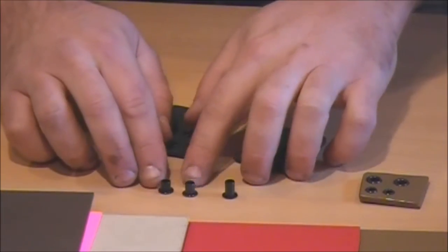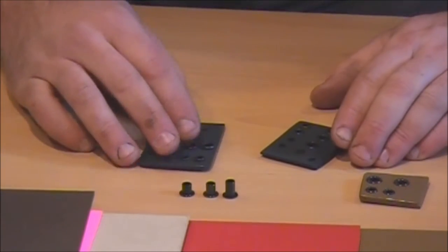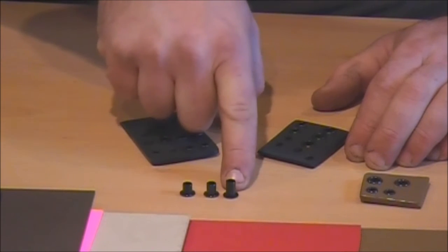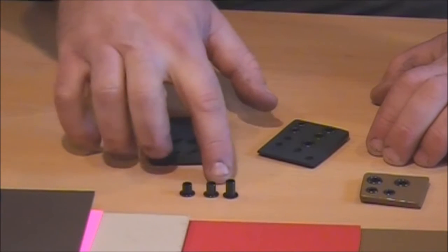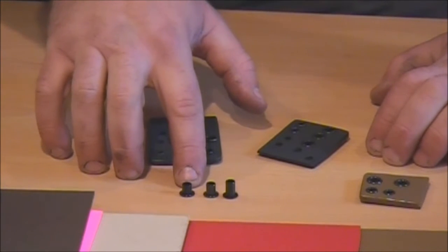Say these are the 1/4 inch rivets. The different lengths here. This one is supposedly for 80 thou, this one is for 93 thou, and this one is for 0.125. So in theory you should use them on the right pair of thicknesses. It refers to joining 2 parts of that thickness together.